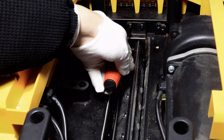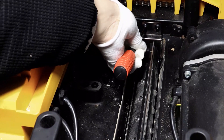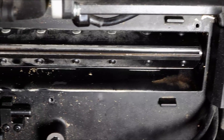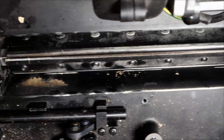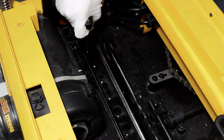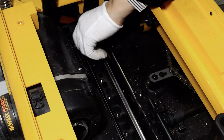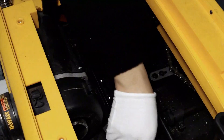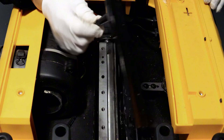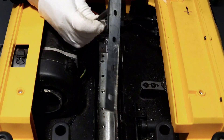Finally, remove the limiting clips of the cutterhead. The original purpose of this device is to make sure that the cutterhead won't wobble when replacing the straight blade. You can use the wrench that comes with it to remove the screws that hold the blade in place — DeWalt has done very well here, it's a very versatile tool with great design. There are two magnets on the back end of the wrench; it can hold the cover and the blade in place to keep your fingers from getting cut.